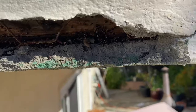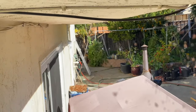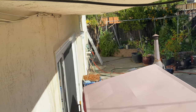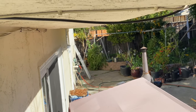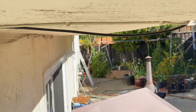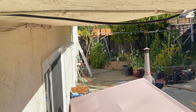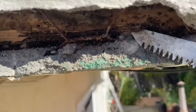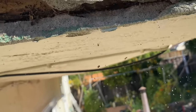This is just inevitable. You will find cracks in almost every house, from hairline to the thickness of a credit card. This piece of wall is hanging over the adjacent wall on the foundation, and the setting process may crack this wall. This is not a fundamental issue. It is fine. But it is not fine if you don't fix it.